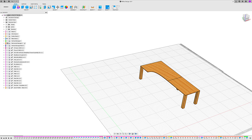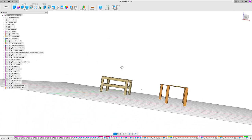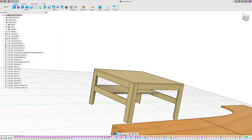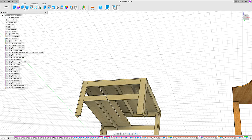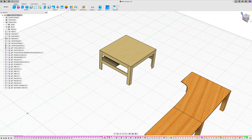I want to highlight the CNC desk — that's actually one of the larger components of the room that I need to design and build. It's large enough to hold the X-Carve and it's got some storage underneath to hold all of the parts of the X-Carve. On the bottom I included these ribs across the entire length of the desk to give it a lot of rigidity so that the X-Carve platform is completely flat and ready to accept a lot of stress that the CNC is going to give to it.